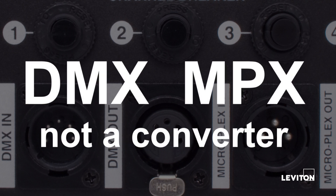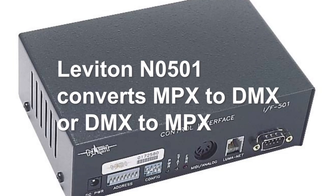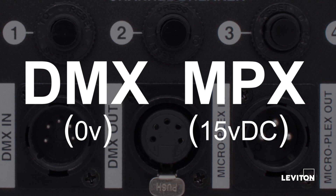Please keep in mind that MicroPlex and DMX are two completely different communication protocols and do not speak to each other. The D4DMX dimmer pack will not act as a converter — it does not convert DMX to MicroPlex or vice versa. Tech support occasionally receives calls from users trying to run DMX with a MicroPlex console, or run 3-pin MicroPlex with a 3-pin DMX console. This will not work. If the connection mistake is made for only a short while, there will be no permanent damage to the DMX portion. However, leaving MicroPlex and DMX connected for hours could potentially damage the DMX side of the equipment, as MicroPlex has 15 volts DC involved in its communication while DMX has no voltage involved.